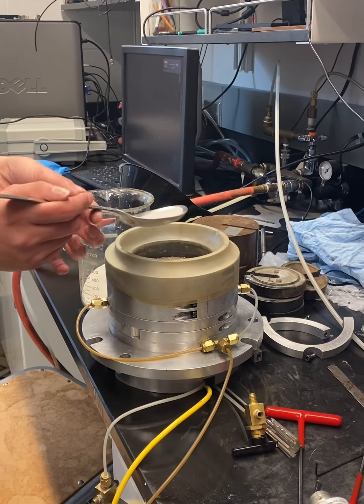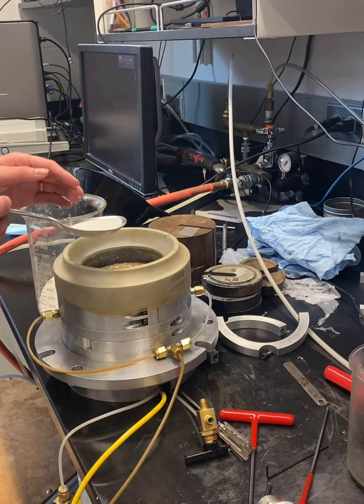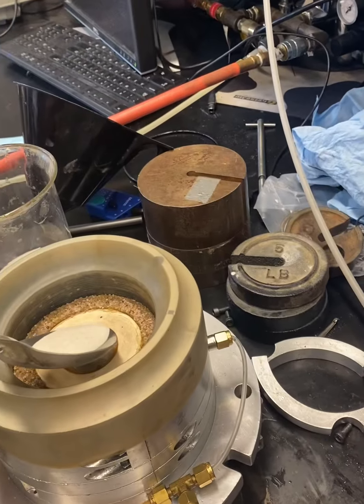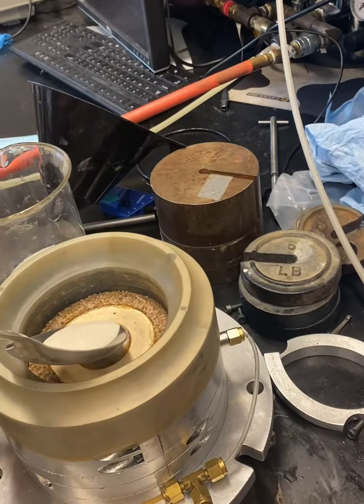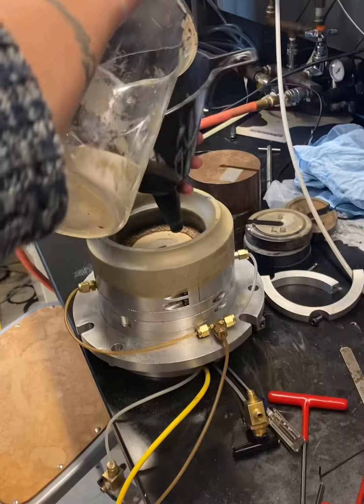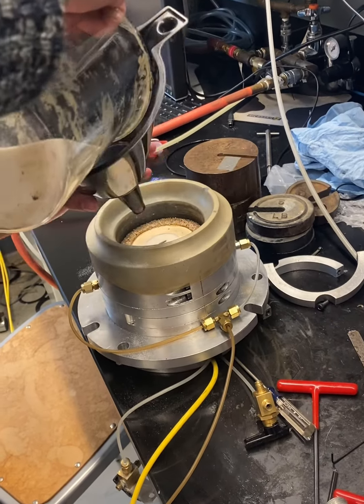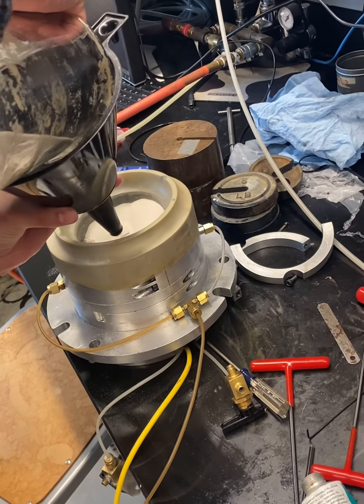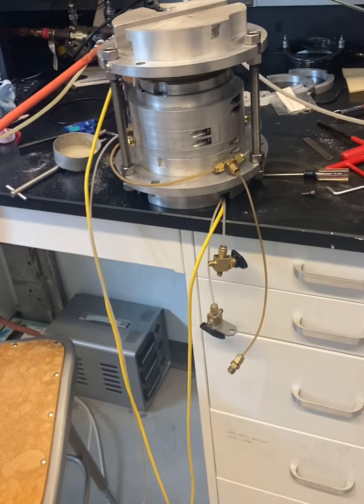So in this video, we're adding just a little bit of extra sand to go around the bender element. That way we can actually prepare a specimen to the exact dimensions that we've calculated our relative density at. So that's what's going on right here. And we'll kind of make it flat, and this is just extra sand, so we'll clean up around it and get all of that residual out. And this is done for the top cap as well, but you might want to wet it to make it stick. Now you're ready to dry pluviate your sand into the mold. And here we had it prepared at sort of a medium dense relative density.